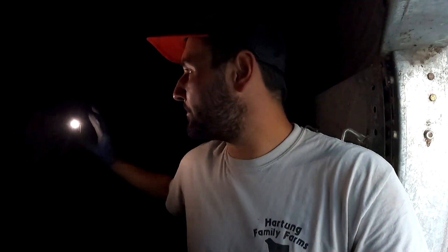What we do to protect our investment are these cables right here — these are the bread and butter. They go inside our grain bin and give us a cross-sectional view, and that basically gives us peace of mind. When these grain bins are filled, there's no way of knowing what's going on — you could have heat, mold, bugs, spoiling. That's a lot of money to be leaving to chance.